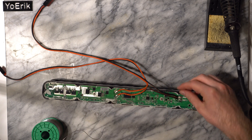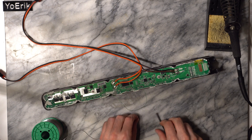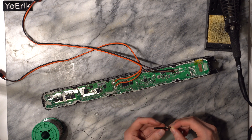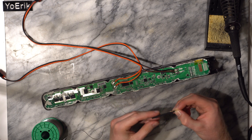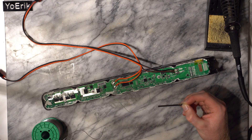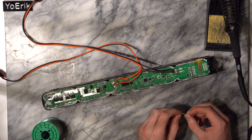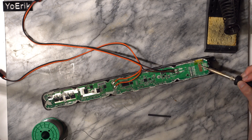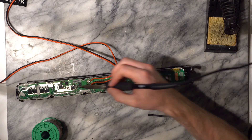Finally, we have to connect this wire to ground at the other side of the battery. Take a resistor with a resistance of approximately 1k ohms and connect one side to the ground pad on the end of the battery. There are other grounds available on the PCB, however this one is easily accessible. This is a large ground pad, so do not be surprised when it takes several seconds to heat it up properly so the solder will flow.